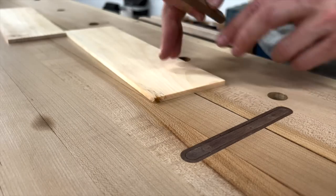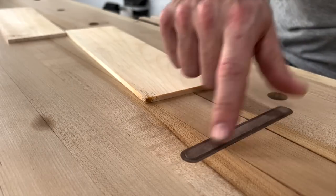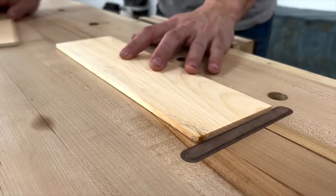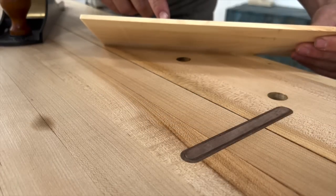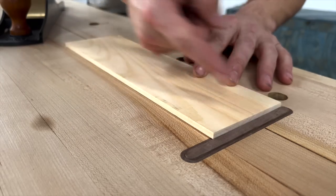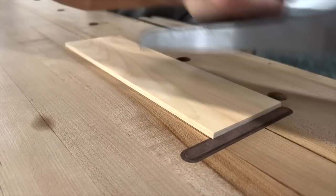The first thing I'm going to do is plane the faces of my pieces. I'm going to take my plane, put in my lowest plane stop — about a sixteenth of an inch — get a well-sharpened and well-set plane, check for my grain direction, see which way it's running. It's running this way slightly, so I'm going to plane in that direction and just take enough strokes to clean up the surface.